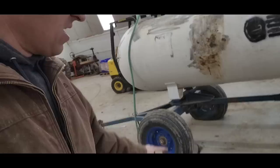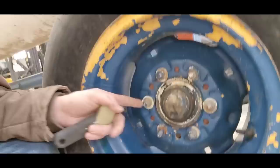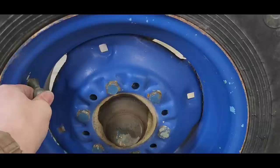If anybody is close to Bryan, Ohio and you need some service work done, go to St. John Tire — there's a lot of good people there. That's my father-in-law. We're back in the shop. I turned the water back on so we can get that tank finished filling up. We got a flat tire over there — I pumped this one up. We're going to fix those. It's finally got weight on it — it hasn't had weight yet. I was just checking the pressure and look at this — this is not right. You should not attach tires with bolts and washers and regular nuts. They just stuck bolts through the back of the hub — that's not right. I would not want to be pulling this thing up and down the road with anhydrous with that system on there.